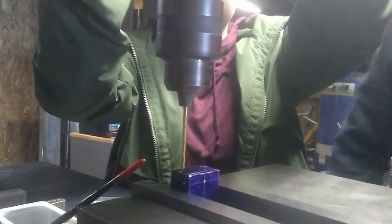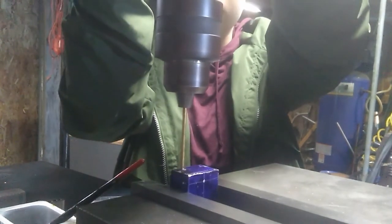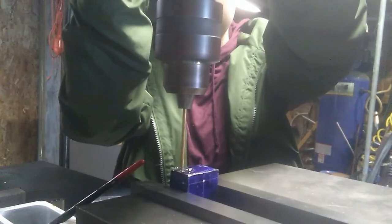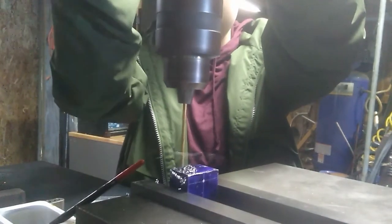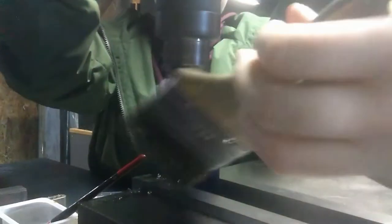All right, here's Grace and Emerson. They're beginning the machining process, and they're pilot drilling right now. They're going to use a technique called peck drilling, and that's just meant to clear all the chips. That's really important. So once they get done with the pilot drill, then they're going to step up to their finished hole size drill and drill it through.